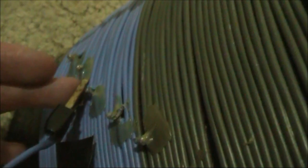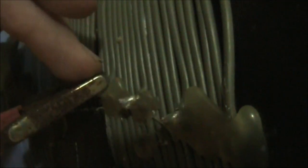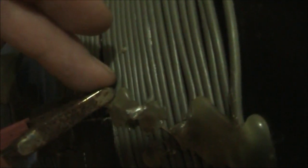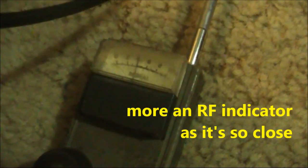There are various tapping points along the coil, every 5 or 10 turns. This point, which is quite close to the earth end, is where the transmitter is tapped. This clip effectively shorts out these turns, as I wound more than was required for 472kHz. Held right up against the radiating coax is this field strength meter. It drops dramatically when I remove the earth connection. There are also large changes when I change the tapping points of either of the alligator clips along the coil.